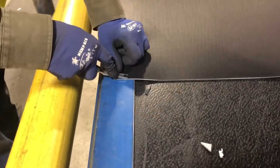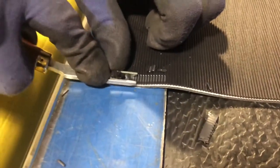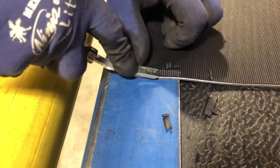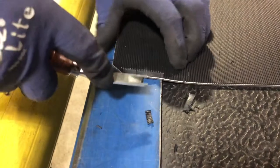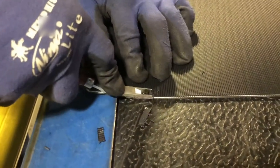On a rough textured belt we have to use a skiver to take off the rough ribs at the edge. Gary's using the skiving tool and he's going to take off all those bumps — that helps the hook stay on. You just take it and run it down the whole edge of the belt to skive the whole belt.